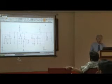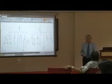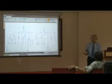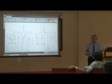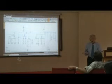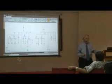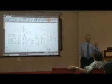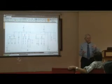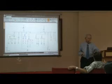Now, the other thing they have in this program, and so does CYME, is suppose you have direct current buses. You have a running aluminum chemical plant or something, but you're using DC. The AC system doesn't work for DC. However, they do have DC programs in their program so you can work DC functions. The problem that the software vendors have is getting equipment data. If this breaker is a DC breaker rated 600 amps at 600 volts, how much will it interrupt? And will it interrupt in a second or a cycle? And so on. The data is very sparse from the manufacturer.